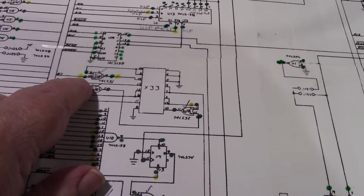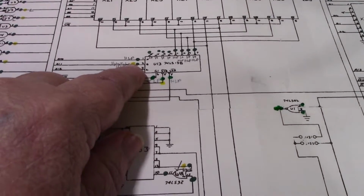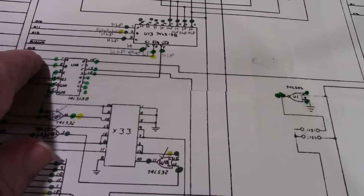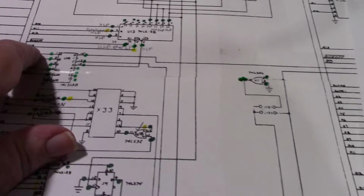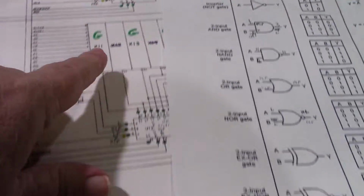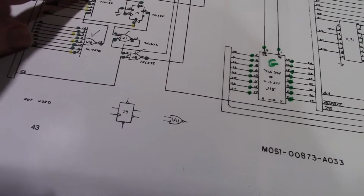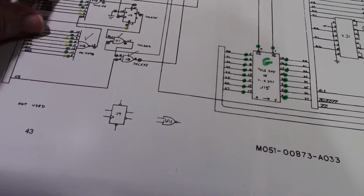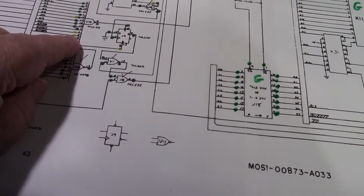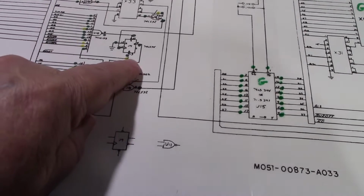Over here we got an inconsistency on A7, which is also an address line. Over up here is A11, which is also on the address line. But we also have A13 again. So A13 has a problem on 3 chips. On this one, and this one. Now, even though I don't have these chips in, I ordered them, but they still seem like they're testing okay. But it could still be the cause of the short to the reset. And we can check the reset.